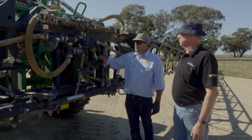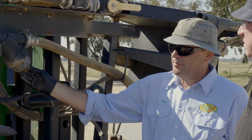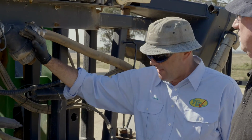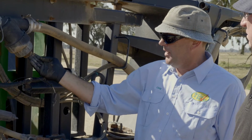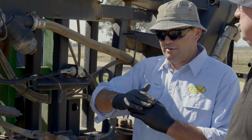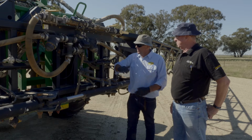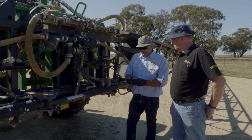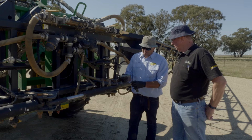Okay, well obviously with our boomline filters here, we've got issues of trapping material at the bottom, so we need to pull those out. We'll be cleaning the inner with our cleaning solution. And also paying attention to where these bungs go in the bottom, because they're a really good trap area for material, and it can really embed in there like concrete nearly, and then it's an area for that chemistry to come back out. This is a trap. The more you pull these filters apart, the more you're going to have O-ring issues, so you need spare O-rings, you know. Especially on a filter like this.